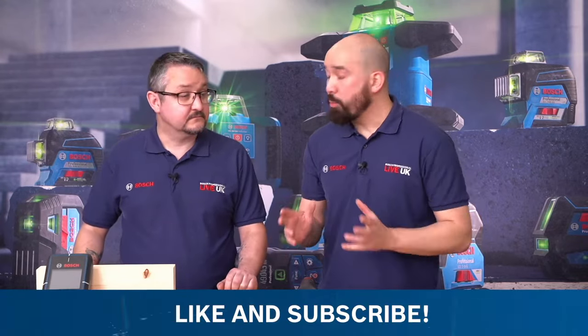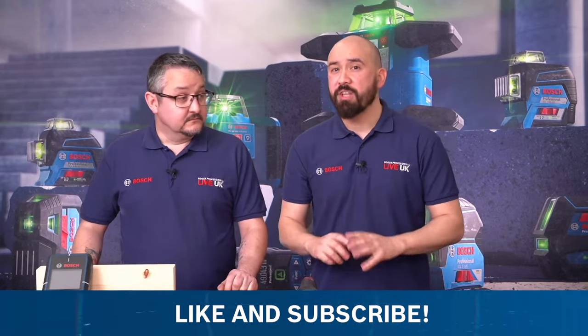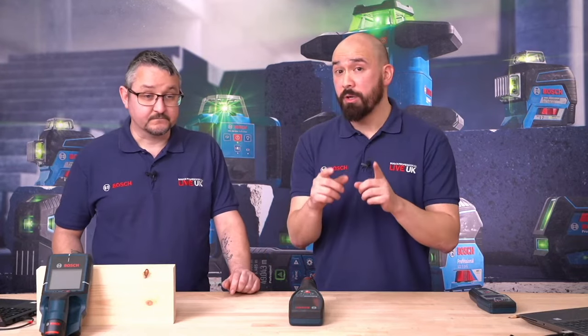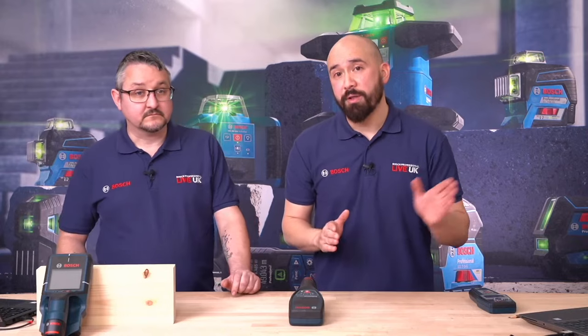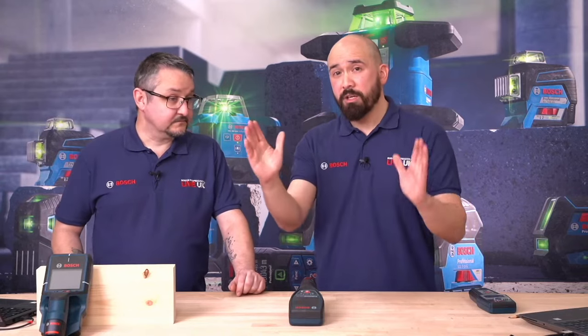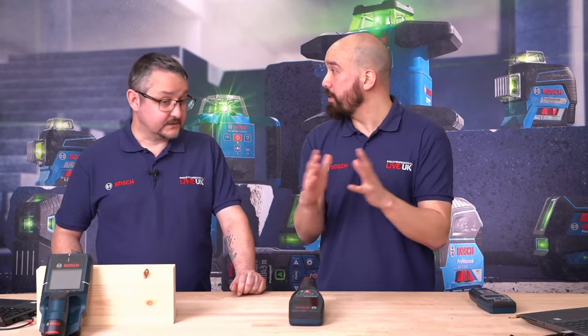Now, let's be honest. Remember, we like to be honest with the audience out there. There's a trade-off here. What you've got is a much faster device that doesn't require calibration. Danny says, pop it on the wall. It automatically starts taking readings and gets the readings really quickly. And I'll show you that in the demonstration in a minute. That's really useful if you don't have much space to do a scan, because remember you need to do at least 40 millimeters minimum to get any decent data. The wider the better. You don't need to do that. You can plonk it on the wall and get your detection straight away.